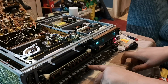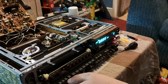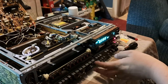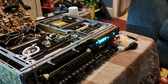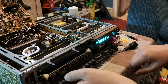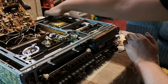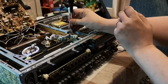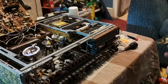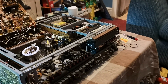That front panel I was on about earlier — when I did the Nordmend — I don't remember having to remove the entire front panel to get the tape cradle out. I believe I was able to get the cradle out without removing the entire front panel. However, it transpires on the Ferguson versions you need to remove the six screws holding in that front panel, and then gently work the cradle out of the machine — which is, I've got to be honest, easier said than done.